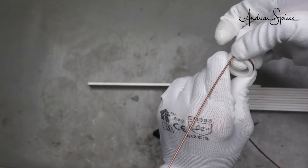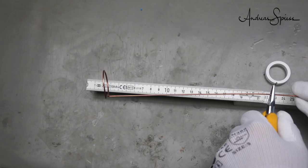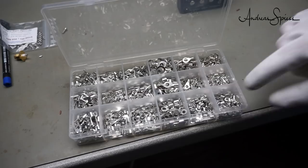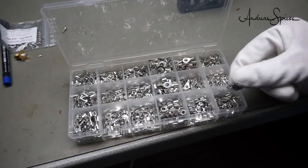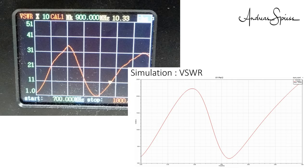Now we can go on and bend the loops. I printed small plastic parts for that purpose — we only have to turn the wire around it and bend them with pliers. At the bottom, we solder the wire to an SMA connector. Now we can measure the SWR. If we leave the antenna as built, we do not get a good response on 867 MHz. Only if we add a ground plane consisting of four wires does it get a reasonable SWR. I made these sticks using naked crimp terminals and an SMA connector with four holes. You find the links in the description. The resonance frequency is, after twisting the loops, at 867 MHz and the SWR at 1.2, which is nearly perfect.